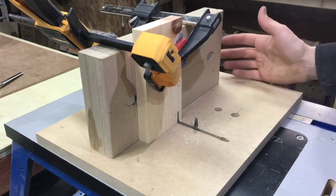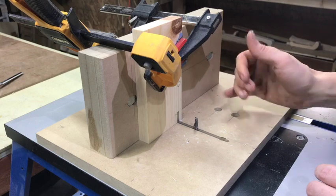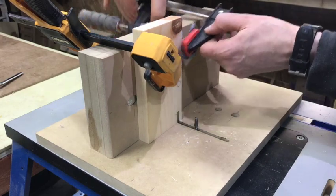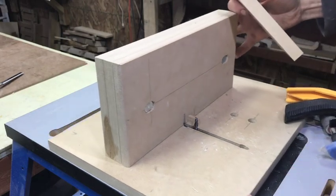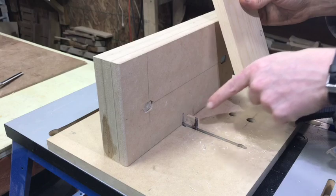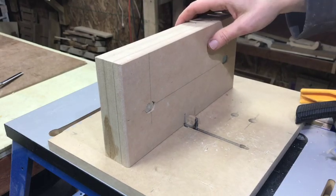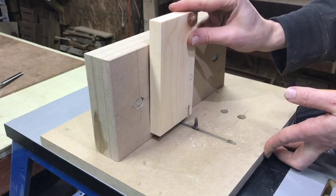As you're making your first cut, just pull until it's just gone through the wood. You don't want to start putting a huge hole in this yet. It will grow over time, but we want to keep our faceplate essentially as a zero clearance plate so that we do minimize tear out. So you see I've only gone in about 75% of the bit. You obviously need the thickest part of the bit to go through, but minimal tear out there with zero clearance. And over time, you will start pulling it a little more forward and forward accidentally, so it will grow. But from the beginning, there's no need to go further.